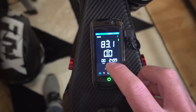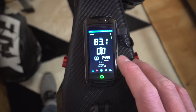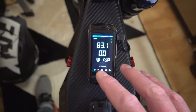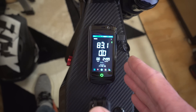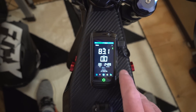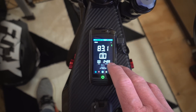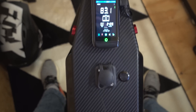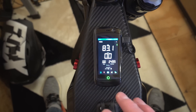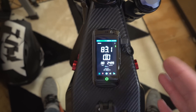This is your fuel gauge which goes down. I've been having a little bit of an issue with it ticking down — when a couple of my cells were going under voltage, possibly because I've got the low cell voltage setting a little too high, the BMS shuts off, which is what you want, but this resets the gauge too. I think it's something to do with the firmware, so there's not much we can do about that at the moment. We've been trying to find out who actually makes these BMSs because I've got some experience with firmware and software and we might be able to change something.